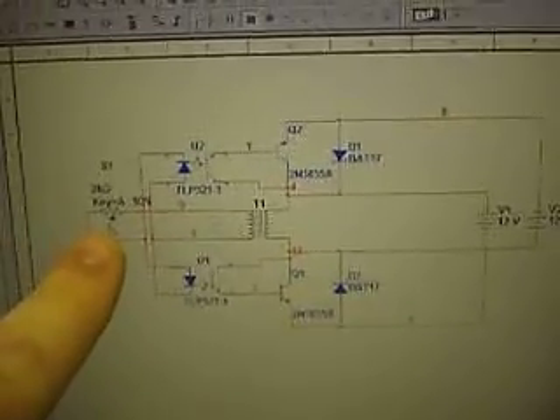So what happens? Well, the theory is there's a top dead centre. It reverses the current flow through the trigger coil, which activates the north side, pushing the magnet away. Pretty simple. So when a south magnet comes along, it activates the north side again to pull the magnet in, and then once the south magnet has passed top dead centre, it activates the south side to repulse the magnet and push it away. Simply enough.